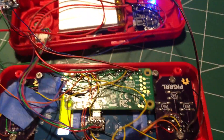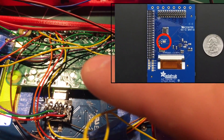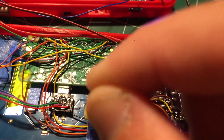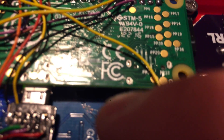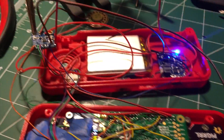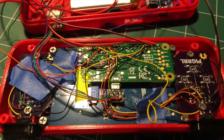One quick issue I had last night trying to put this back together — couldn't get the audio to work. I checked all my pins, made sure everything is plugged in correctly. Ultimately what ended up happening is I forgot to cut GPIO number 18. Just like the 2.2 inch screen, on the 3.2 there's a little pin you almost have to just scrape off and disconnect. That's underneath this Pi Zero, which is problematic. So I found where it was on the board and scratched it off. Once I got that done, the sound's working. Everything works really well.